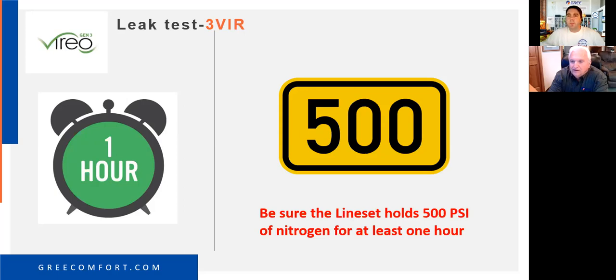Very good point. The thing to point out here, especially with high heat units like these, is that when you're running them on a day of like 45, 50 degrees, maybe an elderly couple needs heat, they'll run close to 600 psi in heating. It's very important, because they'll usually leak on the heating side, since cooling is such low pressure. I've personally seen a leak test at 300 work fine, work all summer, then go to heating side and it leaks. So it's real important to do this 500 psi test and do the hour, because these things really run high pressure. Most certainly.